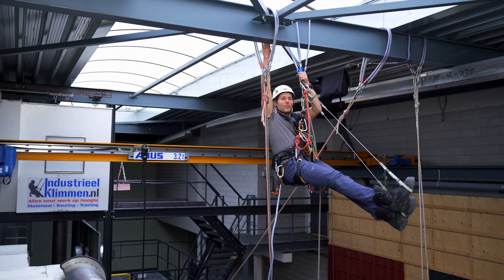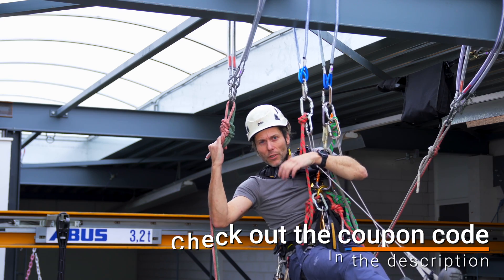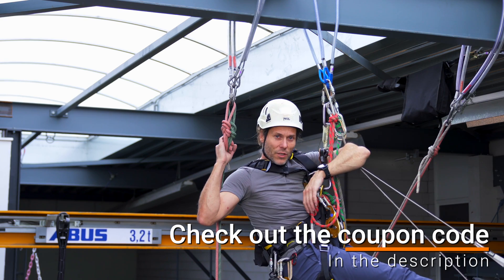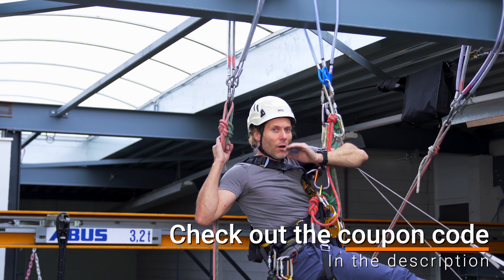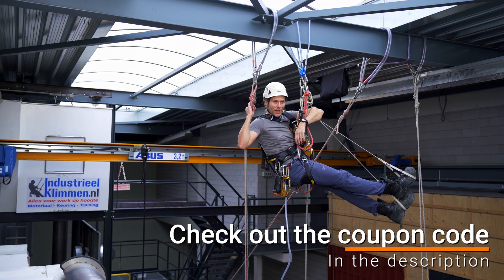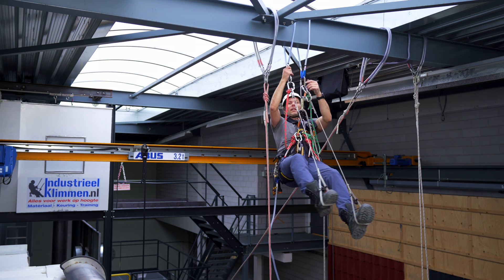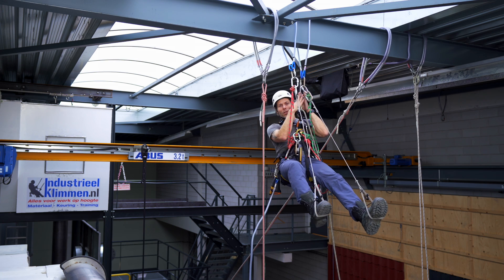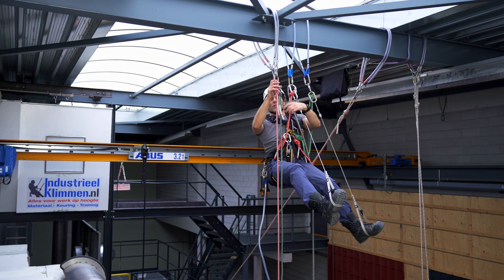Now I've arrived at an obstruction and I need to pass it. First, the sponsor of this video - Industrial Klimmen, a beautiful training facility in the Netherlands just north of Amsterdam. You can come here for all your safe working-at-height related training: GWO training, basic fall arrest, climb training, or your IRATA training and anything in between. There's a beautiful physical store next door where you can try out all the latest gear, and if you can't make it in person you can visit the web store - link in the description. Now, I want to attach my third point, but I want to be a bit closer first. I'll move this one over so I'm directly on it - stand up, click one, click two, and sit back down. Positioned just a bit better.